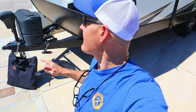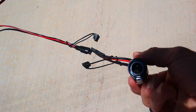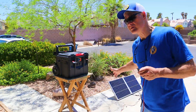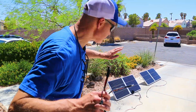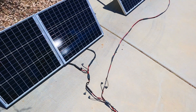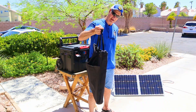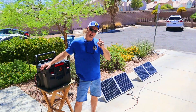Let me show you how easy it is to hook this up to a camper and to a second solar panel. To connect the briefcase solar panel to the camper, I just need the right adapter — this camper has the Furion plug, so I picked up a Furion to SAE 2-pin adapter. To connect a single suitcase solar panel to a solar generator or camper, all I do is plug in my 2-pin connector. To connect a second suitcase solar panel, I just need another 2-pin Y splitter — one panel on each side and the extension cord to the single end. To store the solar suitcase panels, I found these really cool zipper tote bags. Check out my entire playlist for this solar generator and panel project. I'm glad you watched and I hope you'll watch again.